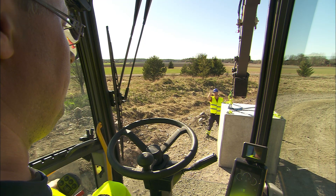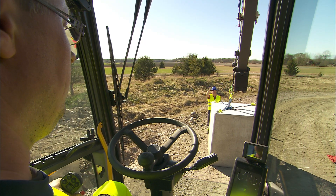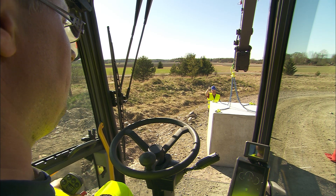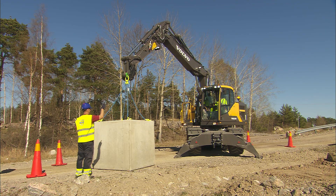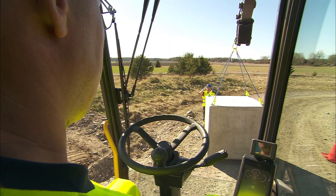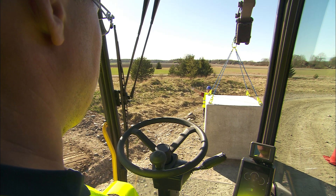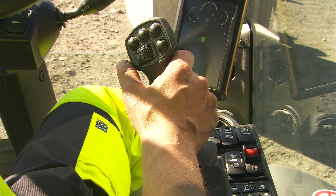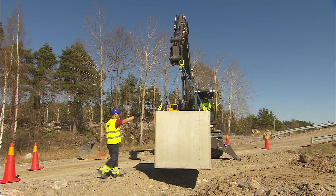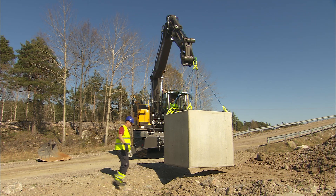The lifting procedure should only be started when you get a signal. Place the hook lined up or straight over the weight. Lift over the rear axle if the outriggers are not in use. Start out carefully with slow and fine movements to see how the machine reacts. If it's secured, you may increase the speed of operation.